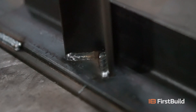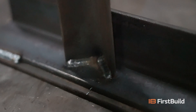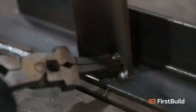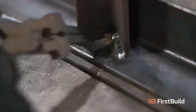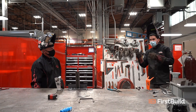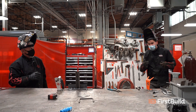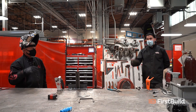You actually did a pretty good job. It could be better — it's beautiful! Once again, we're going to step up and look at some key points. Really good spacing — the apex of the hump is almost at a 45. He's got a good walk between top and bottom through there, and coming out the other side the same way. I have done this quite a bit. There are lots of techniques, but the thing that's going to help you the most is practice. Come to First Build and practice here — get your reps in and your welds will start to look great too.